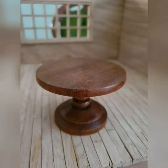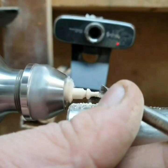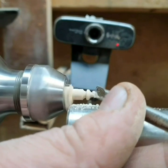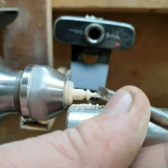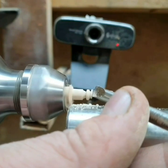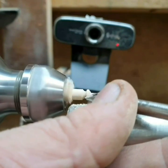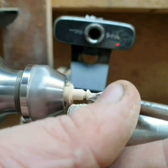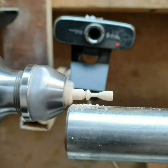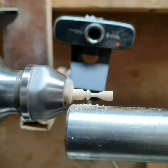All the items are sat in the room ready, waiting to be laid on the table. This is my goblet — a wine glass — and I'm cutting it with my mini skew chisel. I do tend to like skew chisels for this sort of work; it makes life a lot easier. I've done this out of a beech dowel. Dowels are fantastic for this sort of work.